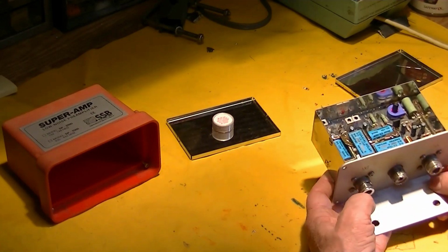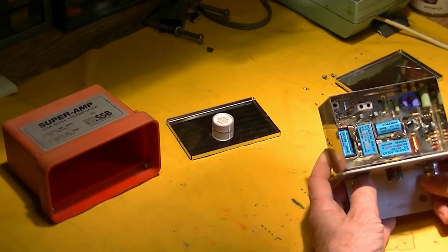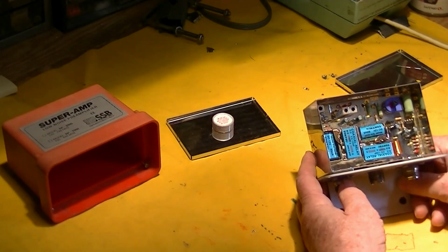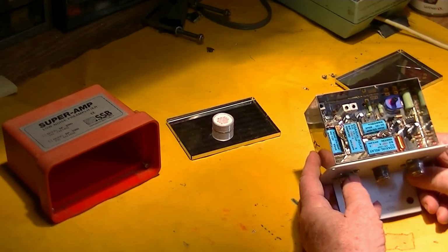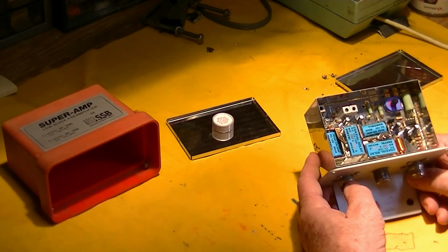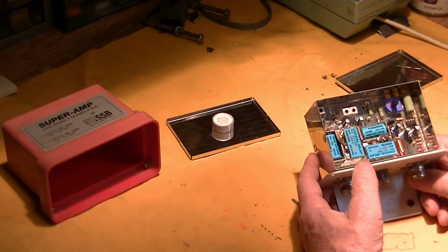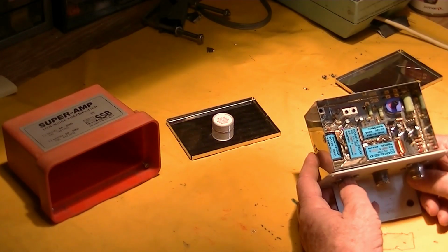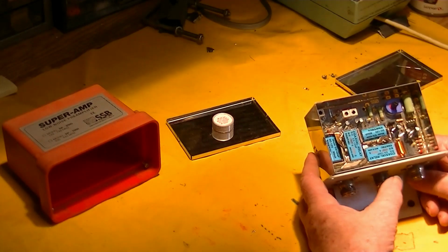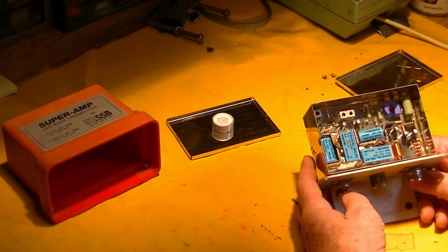I'm putting together a 2-meter sideband station. I'm putting it together out of used stuff. I don't have a lot of money, so the antennas are used, the radios are used, the feed line is used, but I'm trying to use good stuff. I'm going to try to do a short run, 25-30 feet of Heliax between the preamp and the radio, and try to make it work as well as I can with what I got.